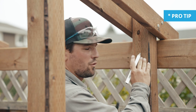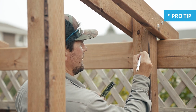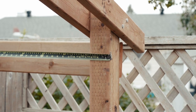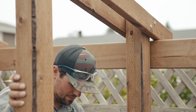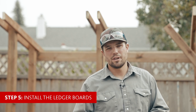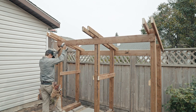I'm going to mark center on this four-by-four, which is an inch and three-quarters on a four-by-four block, and measure four feet from the edge of the board to bring my four-by-four to where I need it. We're on to step five, which is installing the rest of the ledger boards. You're going to want to use the two-and-a-half-inch coated screws for this task. I've already installed the first one, so now we're going to go ahead and finish installing the rest of them.